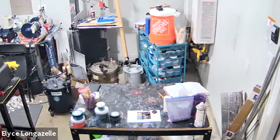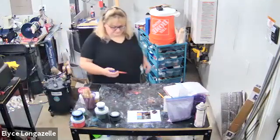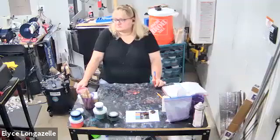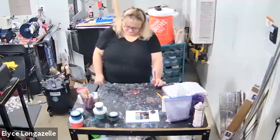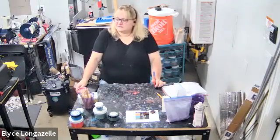Companies like Diamond Cast, it's not necessarily more automated. He's got tools to assist with things. So we poured 300 grams of resin here into 4 molds. He deals with like 20 times that in a single pour. So he's got like a $14,000 vortex mixer. Puts part A and B in there, clicks a button, and 30 seconds later, the whole batch is mixed. And then he can split it up into large buckets, add pigments as needed, and do his pouring system, which is quite frankly kept secret.